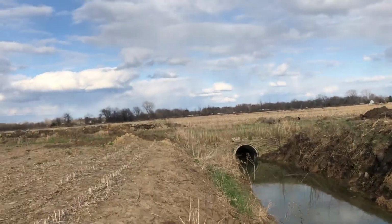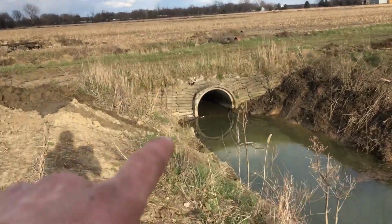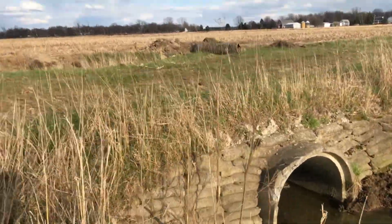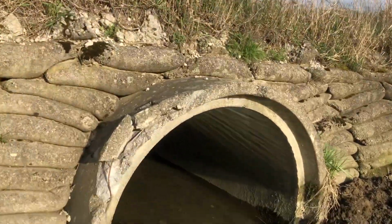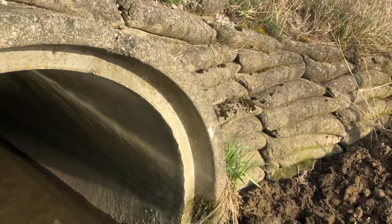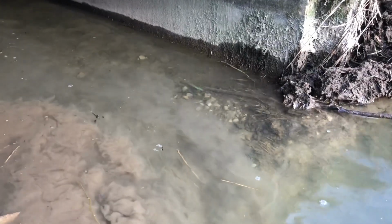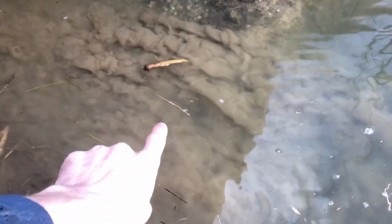I'll show you the water line on this culvert in here. A little bit of it's washed away. I've actually got to get in there and dig that culvert out so I can get this water to get down lower. I'm gonna hop over on the other side for you guys because this side will work good because of the sunlight. So you can see, oh man, I hope I didn't get, oh I did. Whew, water deep. So you can see the top of the water line was right there. And you can see it's about a foot difference between where the water was and where the water's at now. And you can actually see right there it's dropped another 2 inches since. So part of the problem is this culvert is actually filled with a bunch of sediment.